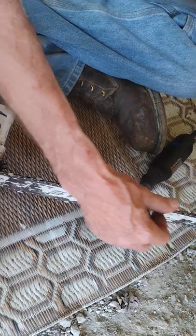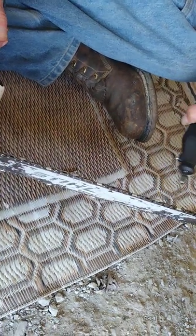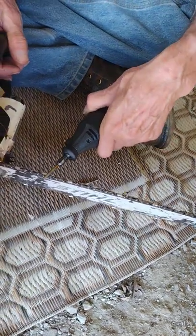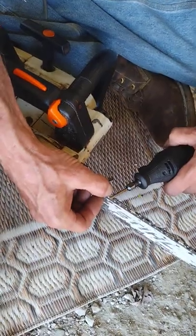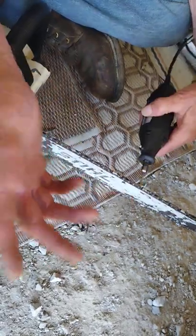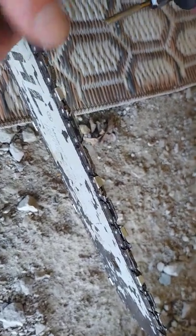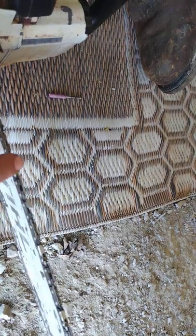You sharpen them even — they can be little teeth on one side and bigger on the other, but you just sharpen the one side more than the other. If it pulls one way or another, get out there and feel which one's the dullest and sharpen only that side, and usually it'll straighten up. They're alternating from side to side — each side is supposed to be even. See how this side is smaller than that side? My brother sharpened it last and this side catches more than that side. When you're cutting, one side will get wore out faster than the other. That's just the way it is.